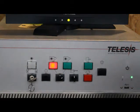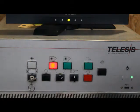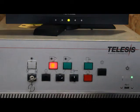There are two safety features built into this. First, even when it recovers from a power-off situation like that, it will not self-energize. You will need to re-energize it by pushing the laser start button. And the other thing is the shutter will not open from the open position. I'll show you that in just a second, as soon as it gets warmed up.